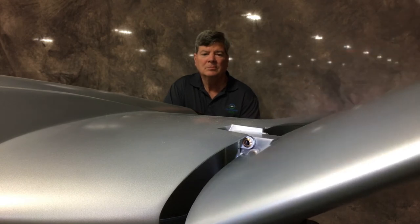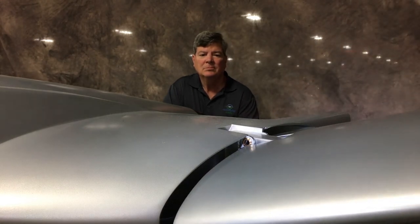Once all ten points are locked in place, green lights indicate flight mode ready and allow the engine to be started. Once the engine is started, the wing fold system is locked out and cannot be engaged until the engine is shut down with the ignition off.